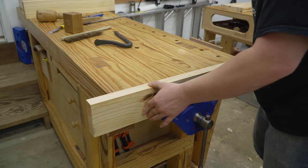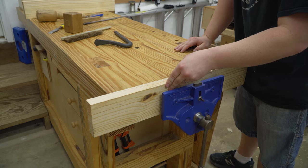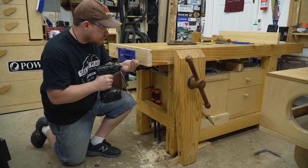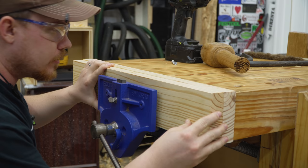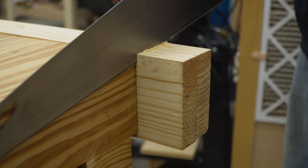It's snug left and right, which was lucky to get on the first try. My top angle inside here is not exactly level with the top surface - I'm flush over here but I've got extra over here - but that's not a big deal because all of this is going to be trimmed nice and flush when it's done. I have a nice fit, so I'm just going to secure this jaw to the workbench with a couple of screws. Now the front jaw goes right in front with the good side facing out. All right, now I just need to trim it all up.